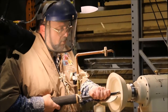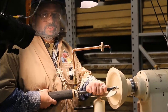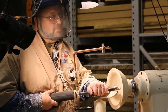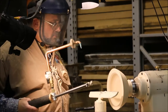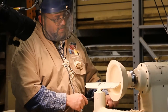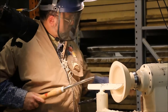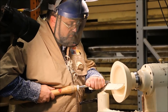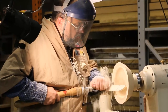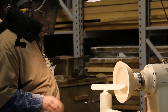If I bring it the other way — bring it down in — I can control it. I can bring it up. I still have the cutters set very aggressively — open about two millimeters, and I really should have it around one millimeter. But just to speed things up a little bit for the demo, I have it at two millimeters. I'm going to close it down in a minute but I'm going to take some more of this out first. Before I go too far, I need to make the rim on my bowl because I've almost gone too far already.